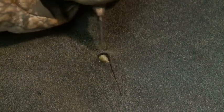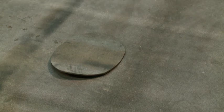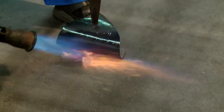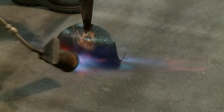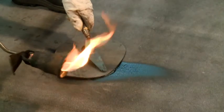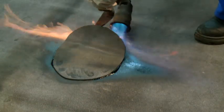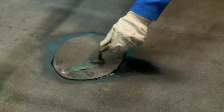In case of damage to the applied membrane, repairs are easy to administer by cutting a patch of Terranap TP and welding it over the damage. Cut a patch that covers an area of 15 cm radius around the damage. Weld the patch with a 45 mm diameter torch on a soft flame. Use a trowel to position the patch directly in the center over the damaged section. Press the edges down while torching the patch onto the membrane. Use the trowel to seal the edges of the repair with the excess melted bitumen that protrudes from the sides of the patch.